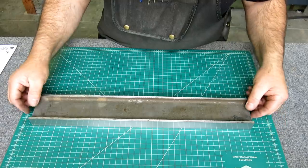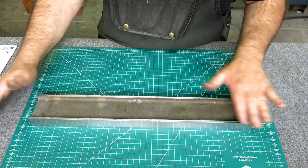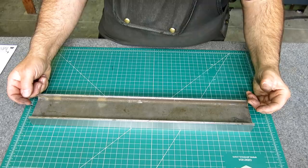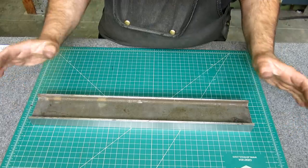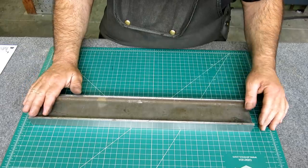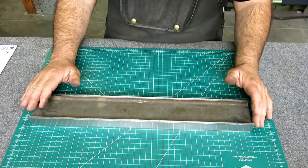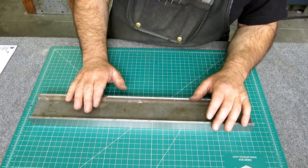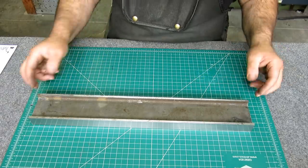It ground pretty well. It's soft, so wheel selection is important. Because it's at the extremes of travel, you've got a lot of table hanging off on either side — if there's any slop in your table, it shows up in your part. That's one of the reasons grinding your chuck is one of the most difficult things you can do on the surface grinder — this hangs out a little bit over the chuck so it's even worse. I got it pretty close — within about five to six tenths. One end had a little wowser popping up, but I started screwing around with it — how good can I get this? I've seen some videos on localized lapping.